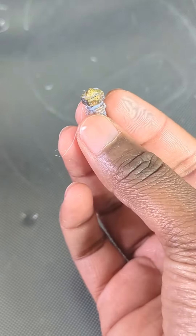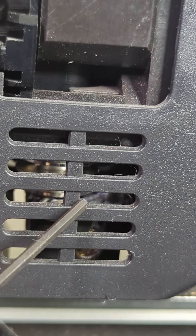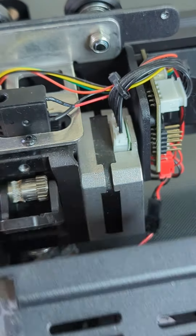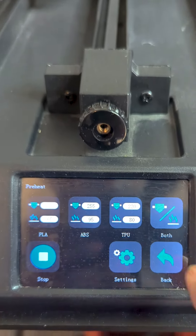Although I'd love to stick to this 0.4mm nozzle, today we're cranking it up to a 1mm. Before switching out the nozzle, I noticed that my hot end is completely caked with plastic. And that brings us to step 1: unscrew the cover unit to see what wonderful present my printer left me.